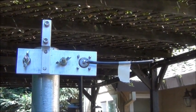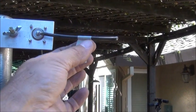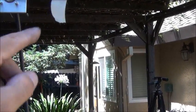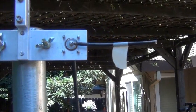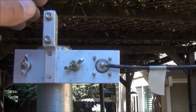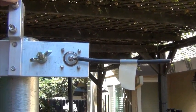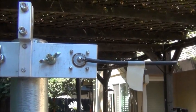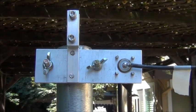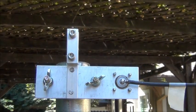I'm getting ready to mount the new round element on the antenna. I've got a piece of tape on the wire that goes into the gamma tube — it shows me how far into the gamma tube it had to be for the right capacitance. On the element, I measured over from the center of the bracket to the edge of the strap to see how far it had to be; it was five and nine-sixteenths on this setup. Of course, that will all vary depending on how the antenna is made, the capacitance, and everything, so it will probably be different in your case. Let's get ready to put everything together.